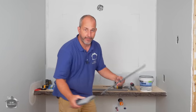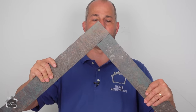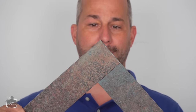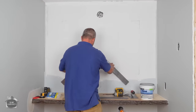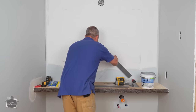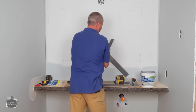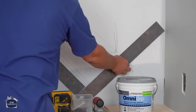The trick, of course, with herringbone is that it overlaps. So you've got to decide, what's your center line? Is it the point, or is it halfway through the tile where it overlaps? That's the magic. Visually, that point is going to be the center, whether you like it or not. So, if I install my tile like this and like this on that center line, visually that's stunning, okay? But this is what happens over here. Boom, perfect finish, right? And that is what we're going for.